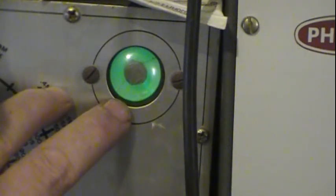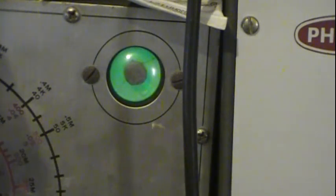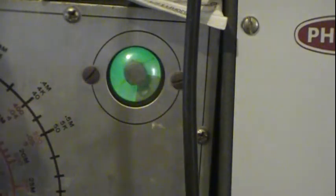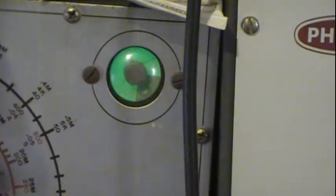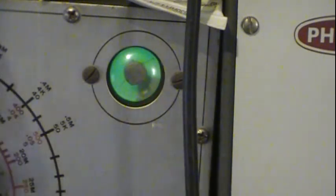we have cutoff. We have the maximum voltage going to the grid, the control grid on the triode. There, we're at our maximum opening, approximately 90 degrees. There's our maximum difference between the two plate voltages. Basically, the grid would be pretty well 0 volts. And then anything in between will make different angles as you float through that.